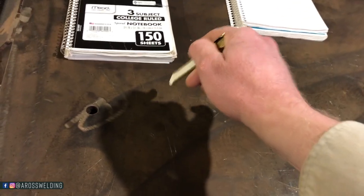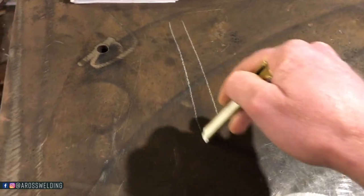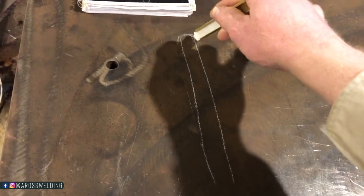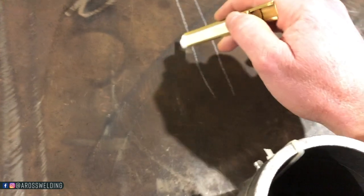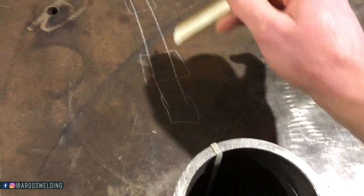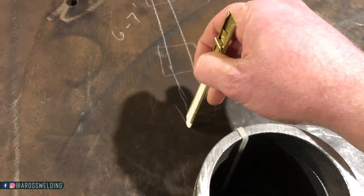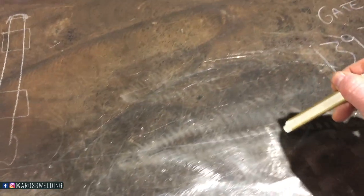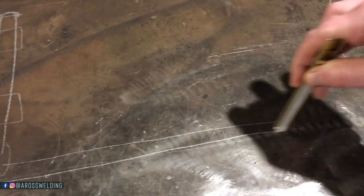So now let's draw the style of gate that we're going to be building. I'm gonna be building the gate out of 2 3/8 pipe and 2 7/8 pipe. I'm gonna have a piece of 2 7/8 about 6 or 7 feet tall, possibly with a dome cap, I do not know yet. But I cannot forget to slide these hinges over that. I need 2 hinges in there. That is a common mistake, forgetting that. So that's gonna be roughly 6 to 7 foot tall. I haven't decided yet. And then from the outside of my gate here, not the outside of my hinge, we want 139 inches. This is 2 3/8 down here. Gonna have 5 runs.